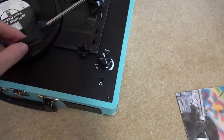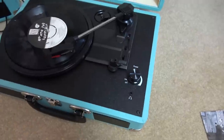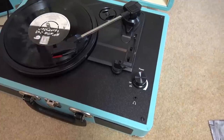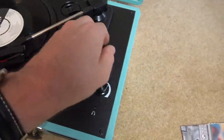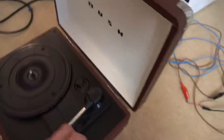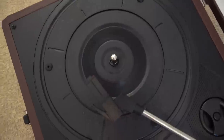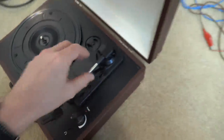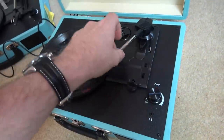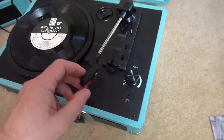Good news here — so it spins and stuff. I put the cartridge on, when I move it over and go to drop it, it will just push its way away from the record. It didn't push itself away, but look, it's not going over. I can't get the arm to move any bit more over than that, yet on this one which appears to be working, I can get the arm to move nearly to the very middle. So there's something not right there.